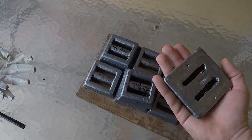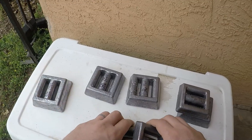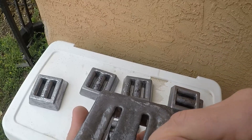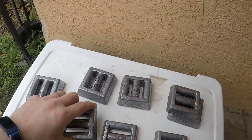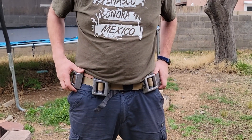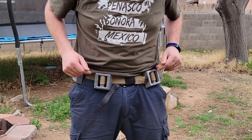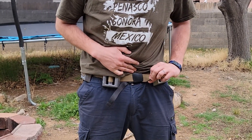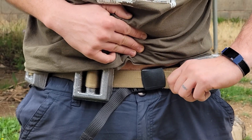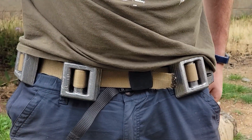These weights have been sprayed on both sides and they've had a day to dry off. So I guess that means it's time to make my belt. So shiny. It's dry. There it is. I weigh about 220, so I need about 10% of my weight — so this is about 22 pounds. You want to kind of have these evenly distributed. It's preferable to have a rubber or silicone belt, and you want to have this kind of buckle so that in any emergency you can pull it off and float back to the surface.